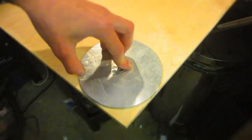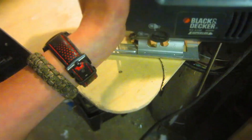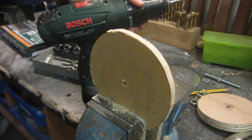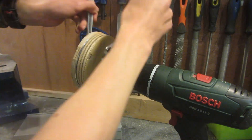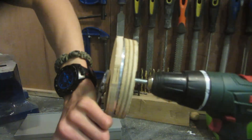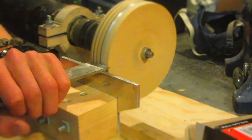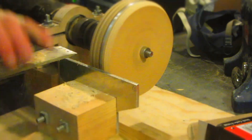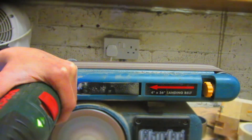For even more support I'm adding another layer of seven millimeter multiplex plywood. Just to prove you don't need a CNC — since some comments get quite annoyed when I use one to cut a circle — this time I'm using a standard jigsaw and pencil. Once it's cut out I again tap the center hole to M8, clamp it to the other two discs already turned true, and turn it true. I also turned a small spike on the end of the M8 threaded rod so it has something to push into the center of the wood.